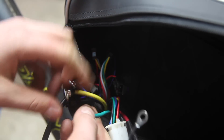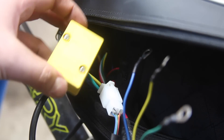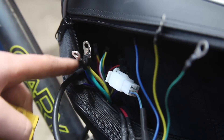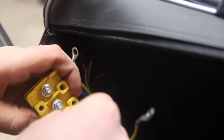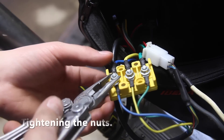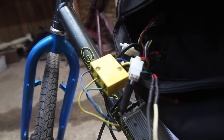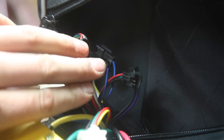On the ESC there is a blue, yellow, and green set of wires — these simply connect to the three wires from the motor using the included yellow connector. You undo the two screws on top, it opens up and has three poles to connect those three to those three. Just color coordinate them: green to green, blue to blue, yellow to yellow, then put the nut on top and tighten it down. For the throttle, it's just a connector with six wires that plugs in one way so you won't mess it up.